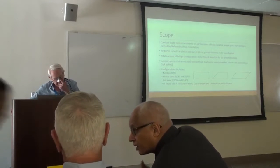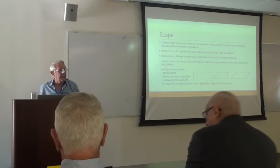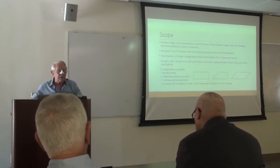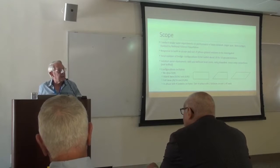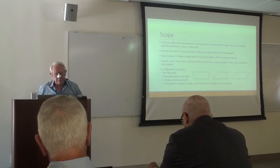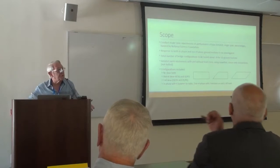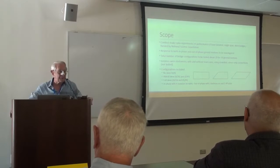We were using elastomeric isolators with and without lead cores for the energy dissipation. And interestingly enough, these isolators had dowelled connections to the structure above and, of course, the floor, the table below. They were shear-only connections because we were concerned that if you had a bolted connection, you would place the elastomer into tension under strong lateral displacement. So that means these isolators could transfer shear but not take moment into the foundations, which means that you could roll them over. If you drove them hard enough, you could make them unstable and they would fall over. And we did that.